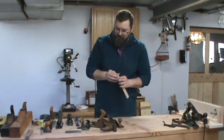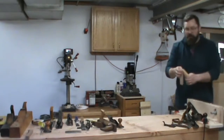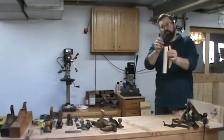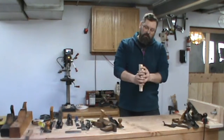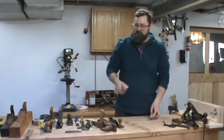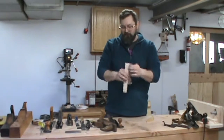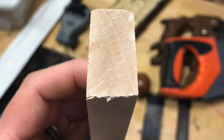You typically want to avoid planing the end grain all the way off the edge. What you would do is take another piece of wood and put them together in the vise so that this other piece of wood will support that at the end, because wood is very weak when you split it — that's why we split firewood. If you have something holding this together, you can plane it and not worry as much about whether it's going to break. If you're making cutting boards, it's always worth it to have an extra scrap of wood to put against this. The end grain looks ugly when cut by a saw, but it looks nice when cleaned up by a plane.